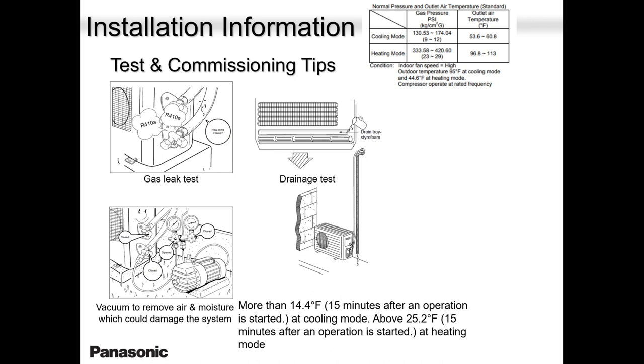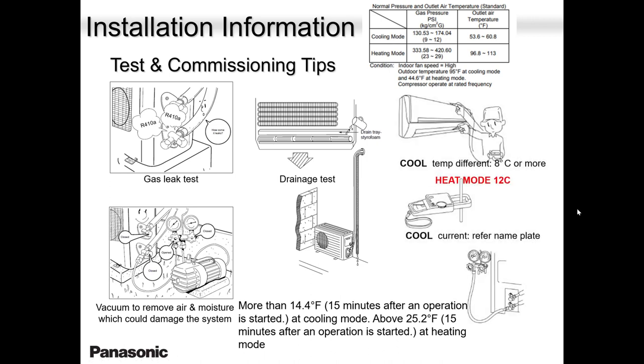And for whatever reason, you are suspecting there is a leak, or you're suspecting that the system has low refrigerant. Your best option and the only option is to recover all that refrigerant by weighing it. And once you find out that the system was low on charge, please charge in new refrigerant. Do not use the same refrigerant that you removed. The composition is all messed up. So please charge in liquid 410 and it should be your new gas, not the same one that you removed. My records are showing that those guys who used the same gas, they were not very successful.